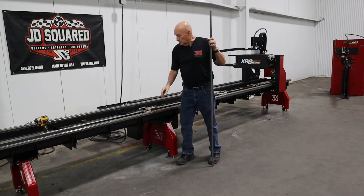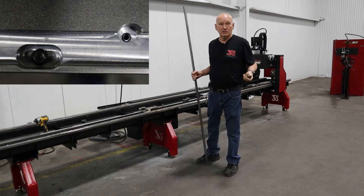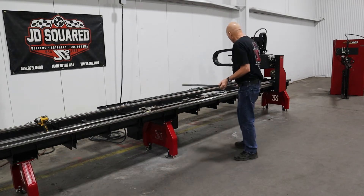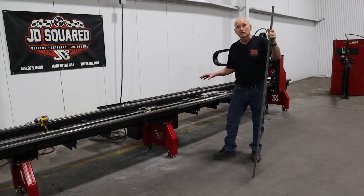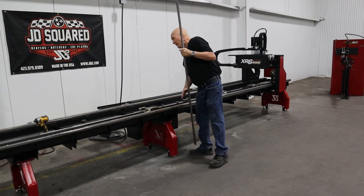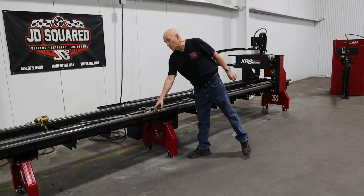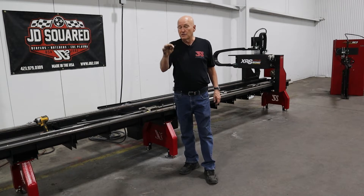We're going to place this gear rack up underneath the rail. In the rail there are pretty long slots so you can shift it fore and aft to match the other one up. I'm going to use this section to mesh it, but first I'll run the bolts up and install this gear rack, bumping it against the existing gear rack in the machine. The rails and gear rack are pre-installed on the main section, so we're just installing the last four. I'm using six millimeter button head bolts — we use these because the bolt head needs to stay below the surface where the rods run.